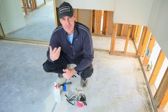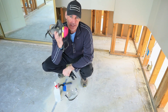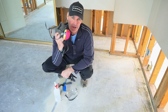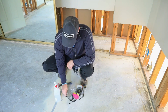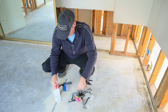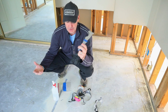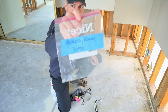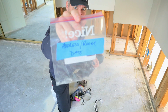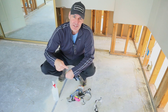I'm going to talk about a few things you need for this project. The most important thing is probably a respirator — this is a P100 respirator. Grab one of these no matter what you're doing in the home. I've got some goggles to cover my eyes, water, something to scrape it with. You can use a screwdriver, and a baggie labeled with the address, the room you took it from, and the date you got it. That's what the EPA recommends. Let's get to it.